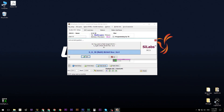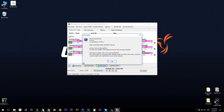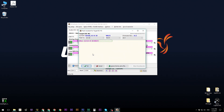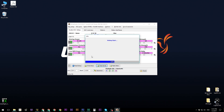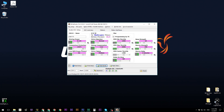Select that specific firmware version, then click 'Yes' when asked if you want to flash the target ESC. You need to do this for all four ESCs. Sometimes it says 'not responding' — that's totally fine. Click OK through the prompts, confirm 'Yes' to write current settings, and continue through the sequence for each ESC. All four will be updated from version 16.2 to 16.4. Click OK when done and we can move on to changing settings.